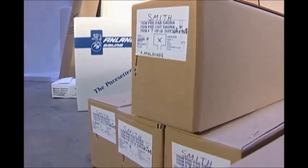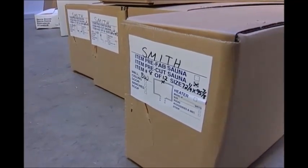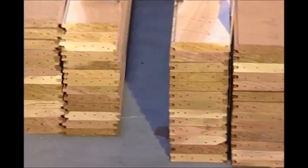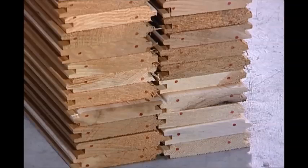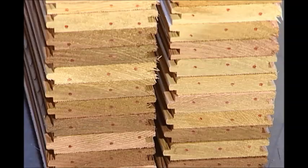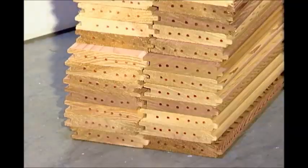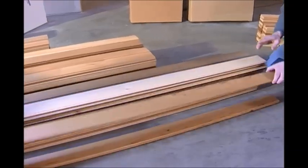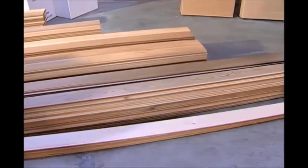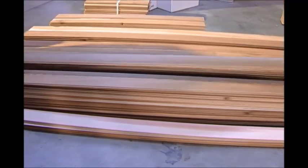Open all the lumber boxes and sort the boards. For your convenience, the boxes have labels indicating the board type. Dots on each end of the board indicate their use: ceiling boards have one dot, back wall boards have two dots, the right wall has three dots, the left wall four dots, front right wall boards are marked with five dots, and left front boards are marked with six dots. Boards are all cut to size. Sort the boards according to appearance — use darker boards, flat grain boards, or boards with minor imperfections for the bottom layers of the sauna room. Ceiling boards do not have to be sorted.